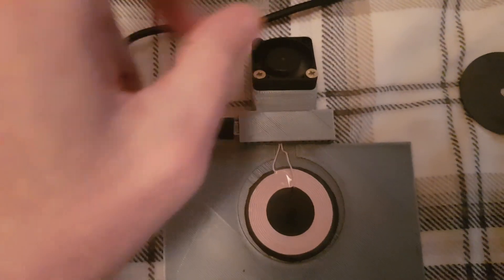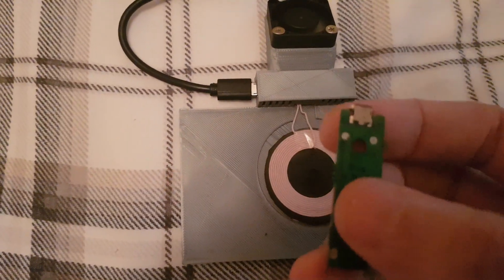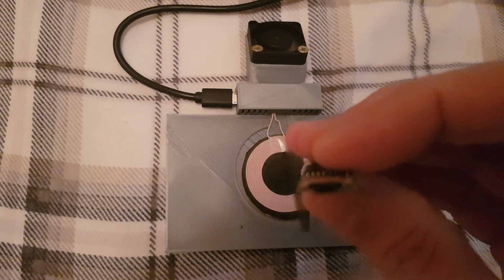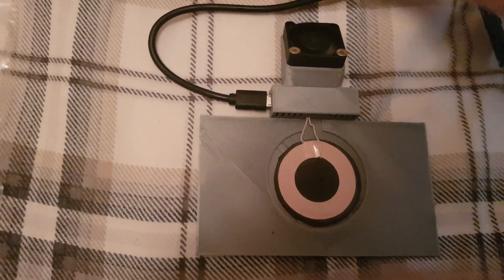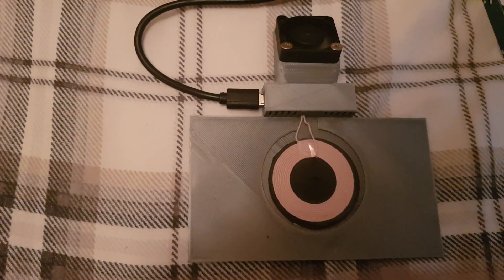You can see it's not pulling anything there — that's just literally the fan using power to keep it cool. Whilst it's plugged in, this fan will draw power because it's directly from those pads, which are connected to the 5V and ground negative of the USB input. So whilst there's power to that, the fan will still run. I'll just turn the power off — and obviously the fan turns off now.